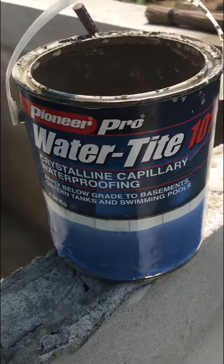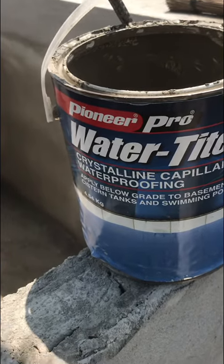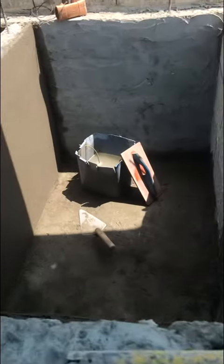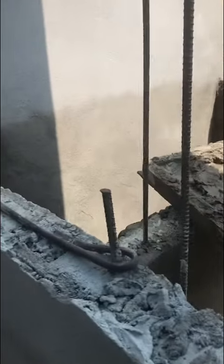After that we're going to be brushing on the crystalline waterproofing, which is applied by brush. Any cracks, protrusions, or anything like that — the crystal will grow into it and give us that extra bit of waterproofing to make sure that nothing leaks inside the house or down into the hallway below.